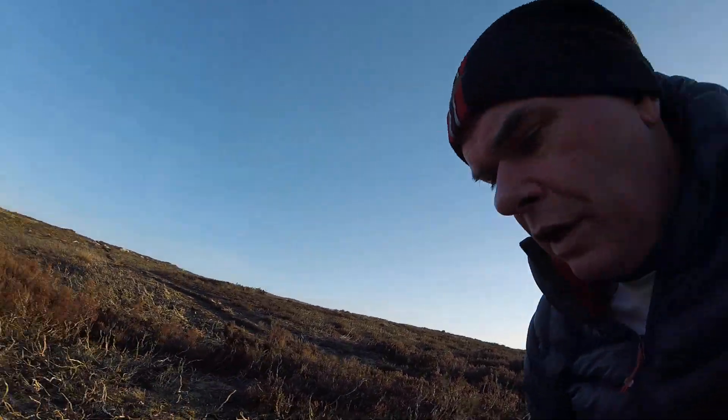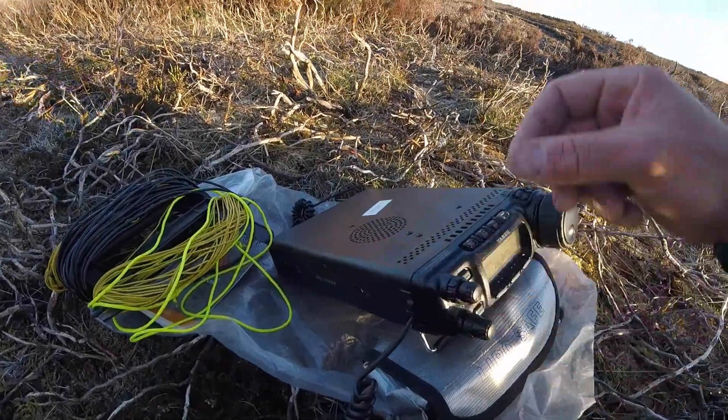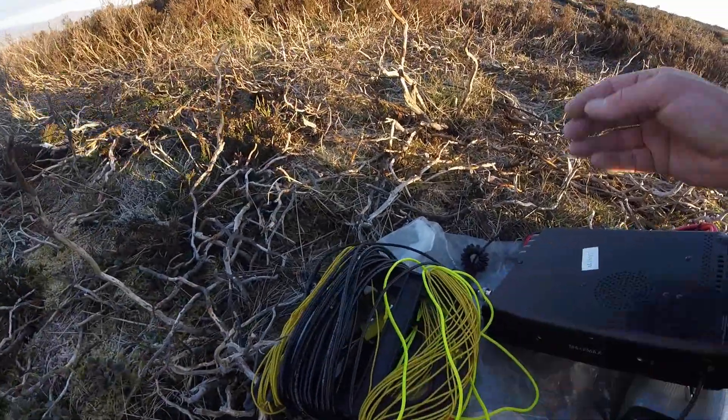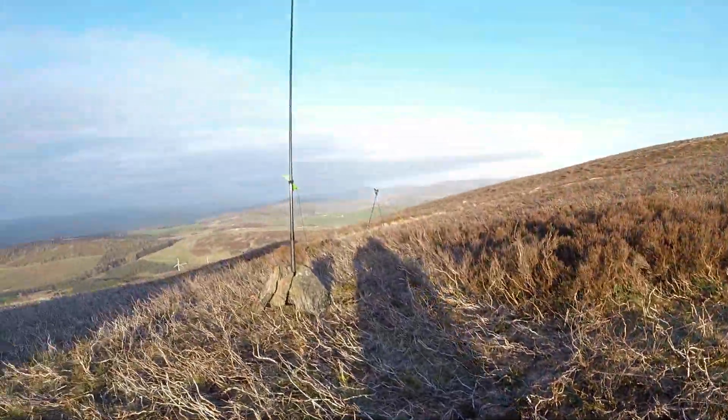Quick run through the rig — we've got the FT-857. That is a common mode choke, and that's just my spare antenna. I've got five metres of RG-174 going out to the mast. People have been asking me, do I have to use an un-un at the feed point? I haven't, and I haven't had any problems with interference or RF — I'm only running 30 to 40 watts tops. If you want to run higher power, it would make sense to put some kind of un-un at the feed point, but the common mode choke at the radio seems to be doing the job for me.